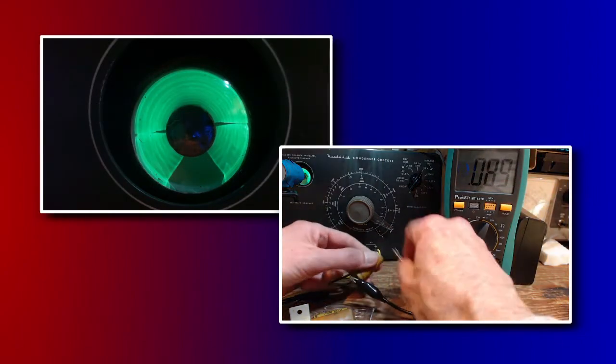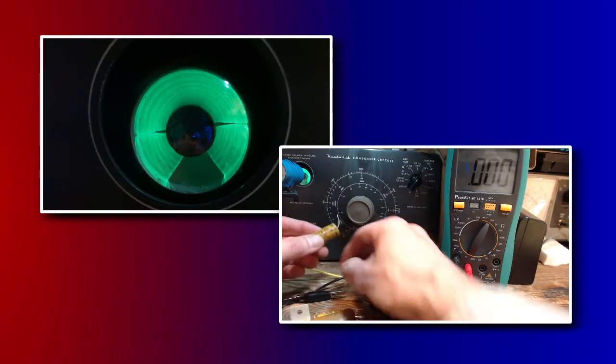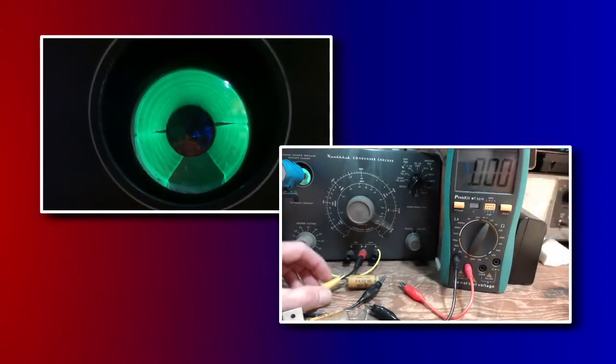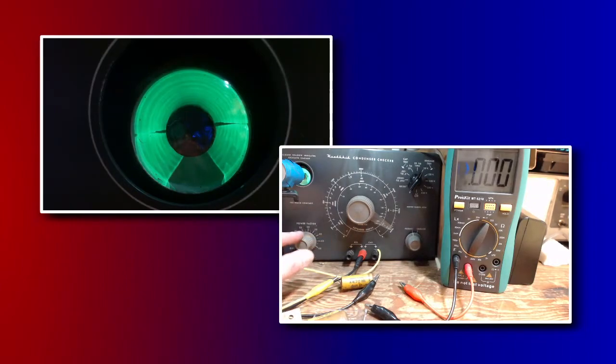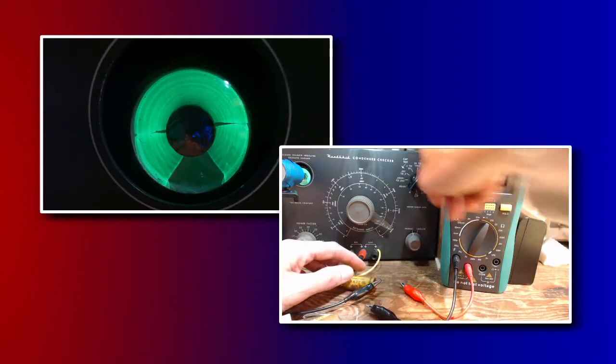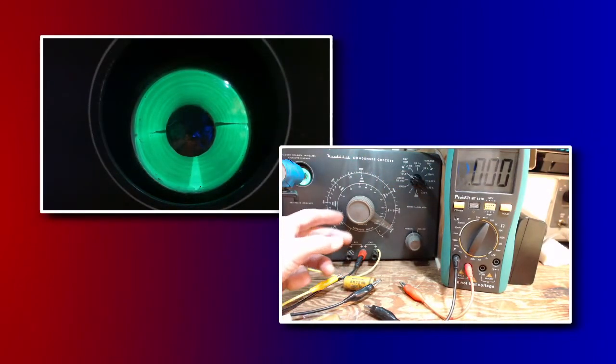Now I'll switch to the other tester. You might notice there's another control here called power factor. Power factor measurement has to do with dissipation, heat loss in the dielectric under alternating current operation. I can't use this feature on these small capacitors. The capacitor tester disables this feature except on the highest settings for large capacitors, and we're not doing any large ones here at all. So can't fiddle around with that control. Now, what are we going to get here? Okay, 0.05. Let's get back over here. 0.05 would be in that range. So a little wiggle there.